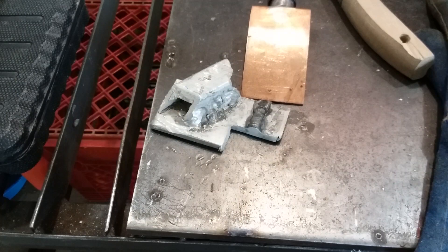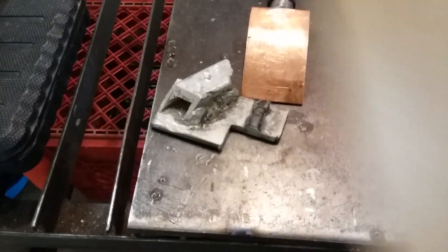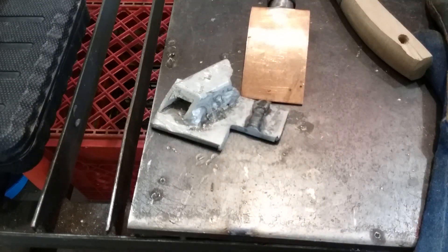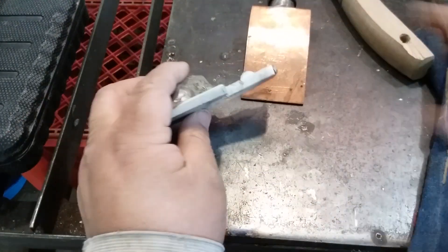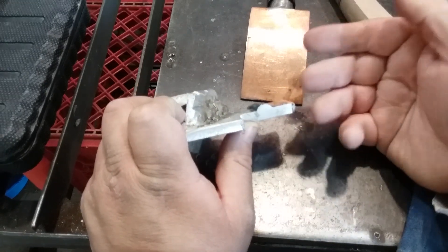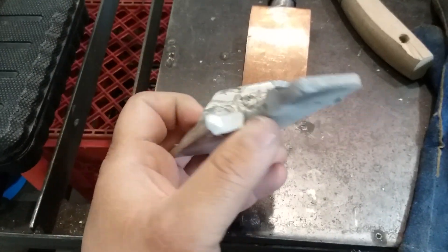With AC you get the cleaning action. For etching the welds, hit it with a flat disc, then a cheap piece of 1000 grit, then come in with some oven cleaner — this is dollar store heavy duty oven cleaner, for a dollar you can't beat it. The best results are heating the piece up really hot, then hitting it with the oven cleaner and leaving it a couple of minutes. If it doesn't etch well, clean it, heat it up again, and repeat.